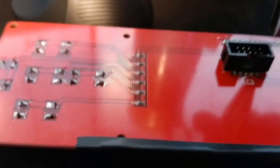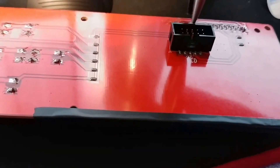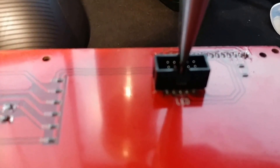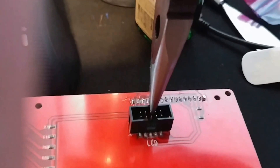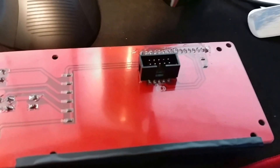I'm not going to actually pull this one off because this one works, but all you do is just grab it with either needle nose or smaller pliers. You don't want to bend the pins. If you do, you can bend them back. Just be gentle with them, but you're going to grab onto it and pull this connector off. It'll slide off the pins.